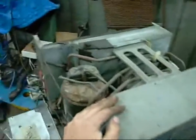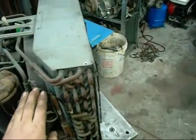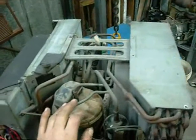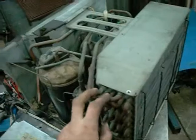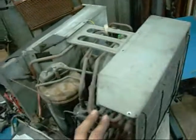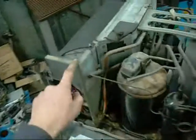That pretty much concludes this video. It is possible to make an air conditioner at home, and many have succeeded using refrigerant. But a good understanding of how the cycle works, as well as some equipment like a gauge set, is essential to building one. You can use them to heat water, you can use them to chill water - you can use them for pretty much anything that involves heating or cooling. You just have to design and size your evaporator and condensing coils appropriately.